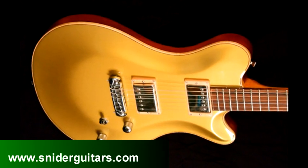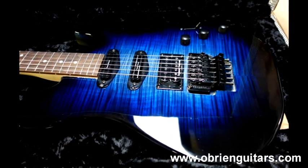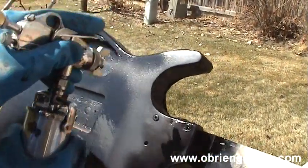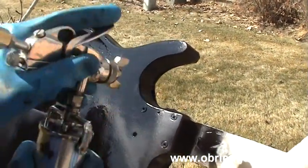A color coat can be quite simple, like an opaque solid color on the guitar. It can also be quite detailed and ornate, like a sunburst finish. When I do an opaque color, I first sand the guitar up to the appropriate grit, usually 220 or 320, and then apply a sealer. I then apply color to the top coat. That way it's reversible — if you don't like the results, you can sand it back to the seal coat without having to sand back to the wood.